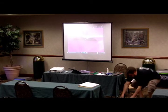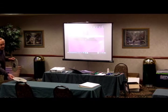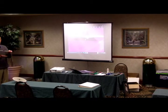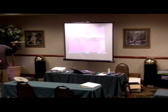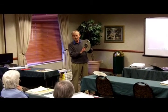We're seeing more and more now, because as you know, these players do not transport well in a box. What happens is when they drop like this, the spindle of the platter loses grip and comes out. Now if you try and play the player, of course, several things will happen. Usually there's a grinding noise when it goes around. So this has to be reset back where it should be.